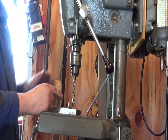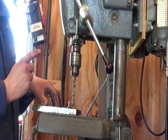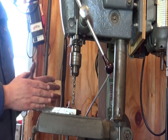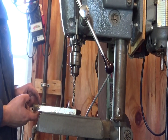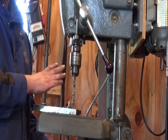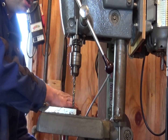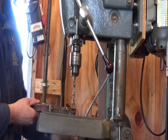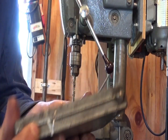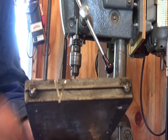I'm drilling the holes in the upper adjuster mounting plate and the plate that's going to go on the C-frame to hold the upper adjuster, and I'm doing it at the same time so the holes line up. The way I'm keeping everything lined up is I tack welded the two mounting plates together so I know if I drill the holes at the same time they're going to line up. I also took the cutoff wheel from the grinder and cut a V-shape on it, right there, so I know as long as this V-shape remains when I bolt it together, all these holes will line up.